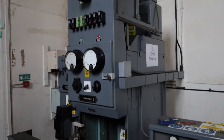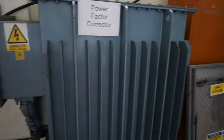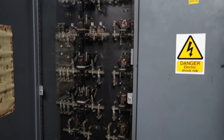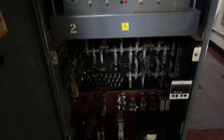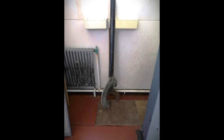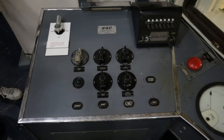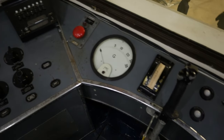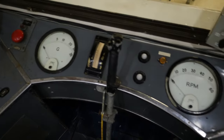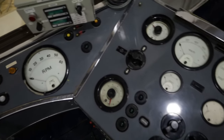Here is the plant room, which is the brain and powerhouse of the entire building. The incredible amount of electrical machinery in here takes power from the national grid and converts it to spin the centrifuge arm under particular control to test specific G-forces, using a motor speed control system. This room also houses the control desk, the program cam unit, and various audio-visual communication devices, as well as a view from the gondola camera showing the centrifuge subject and the teletorque system.